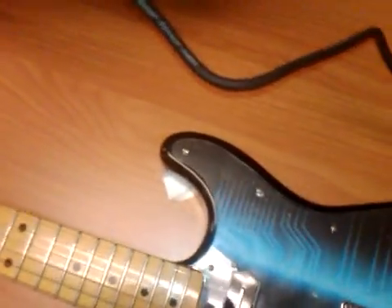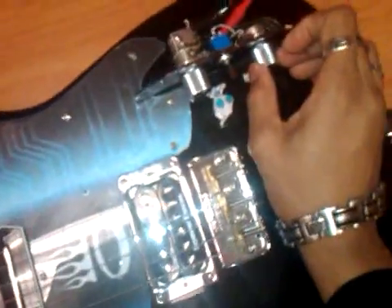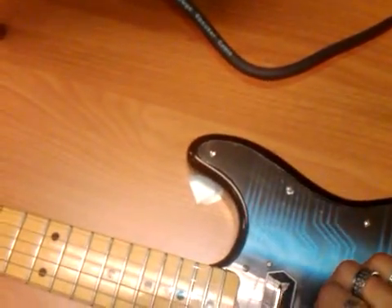And it also is very woolly. Turn the tone control all the way up, and it's still too woolly. So it looks like the winner of this contest is the 0.001UF ceramic disc capacitor, which we will now be soldering into the bridge pickup's pathing.